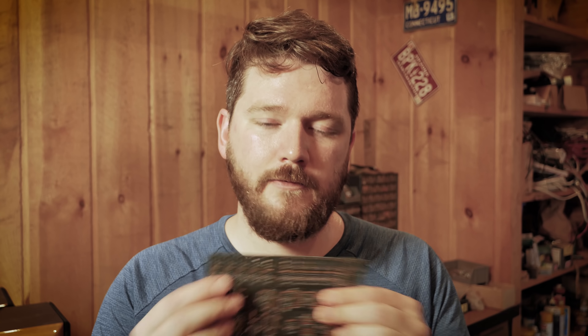However, I'm not starting with simple kits. I'm going to be doing these DIY projects from the ground up. First off, you'll need your PCB - I ordered this one from a company online, but if you get the schematics from Mutable Instruments' GitHub, link in the description below, you can get these things fabricated yourself. You'll need your components from the Bill of Materials, also from the GitHub. That is essentially a list of components with their corresponding positions on the board - R5, C10, IC10 - and it tells you what each component is. In the Mutable Instruments Bill of Materials, it gives you a Mouser part number that you can put into mouser.com to order it.